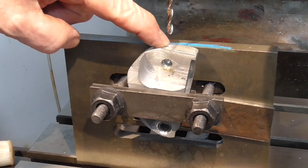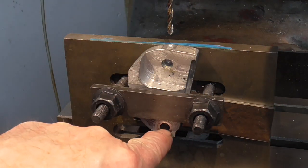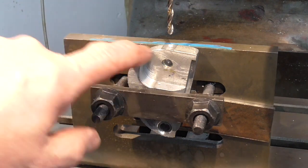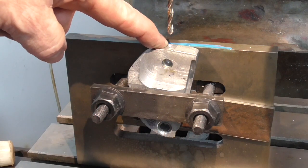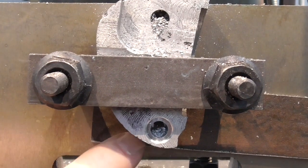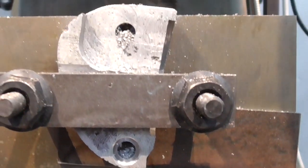We're aligning both directions. I've got a little spot on there to start with. I think I'll just about get through with a standard drill, so I'm going to drill through here into that hole, through that hole, and out into that one. I'm going to do this off camera so I'm close up — I can't have the tripod in the way. Then if that works out okay, we can just tap this to take a grub screw to seal that end off. We can see some drillings have just come through; I'll continue on, clean up, and then spray some solution through.